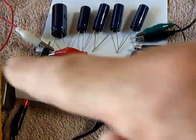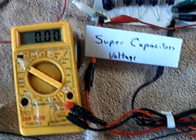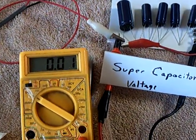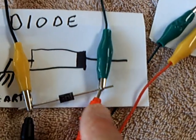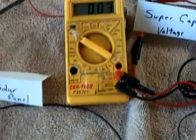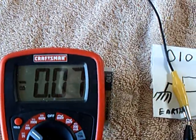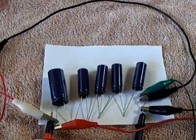Those are the supercapacitors right there. I've got the wires leading in here and they're grounded out. I'm going to unground the supercapacitors. There's supercapacitor voltage slightly climbing — you'll get a little bounce out of that. I'm going to connect the earth ground. This is the earth ground, and the voltage I'm actually recording is across a diode here, which is very strange. I don't know why the reading is that way, but that's how it's happening. Now you're going to start to see these voltages climb very slowly. There's a voltage coming up on the earth ground, and the supercapacitor energy level will start to climb.